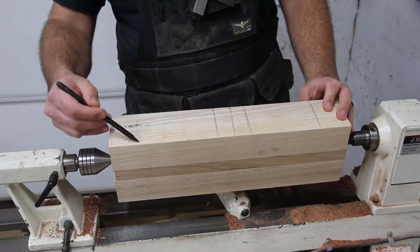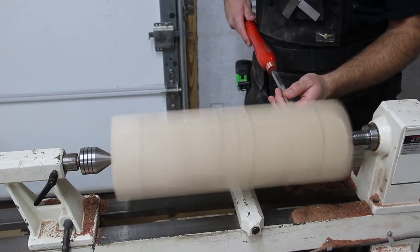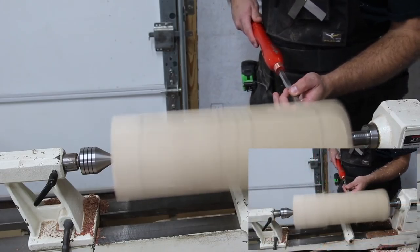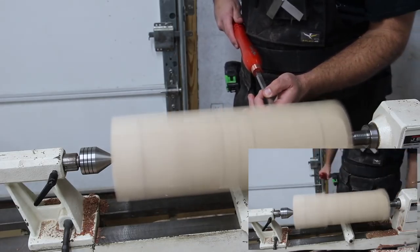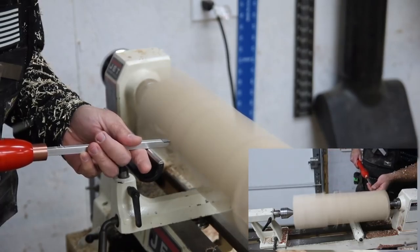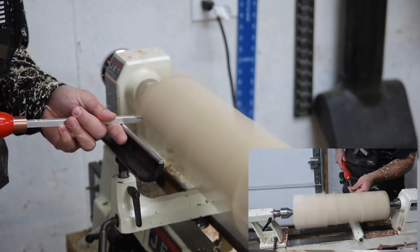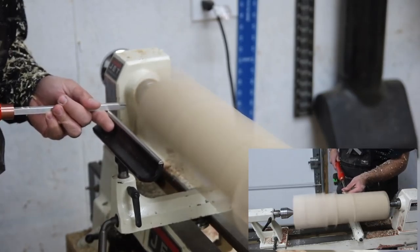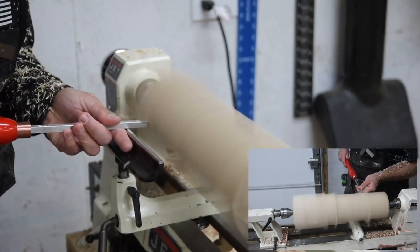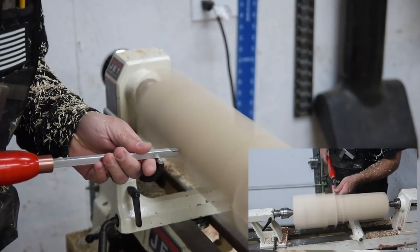The first thing you saw me doing was planing down two sides of the blank — really all I'm doing there is eliminating a step later in the process so I don't have to sand. After I get that done I can put it on the lathe and start turning it down, basically getting rid of the corners. You can skip this step and take it to the bandsaw or even the table saw to get rid of the corners, but this is really just personal preference — I just like to put it on the lathe and turn the whole thing.